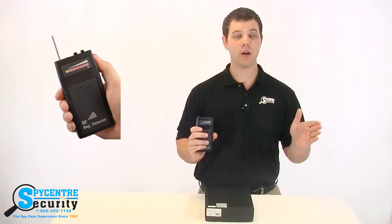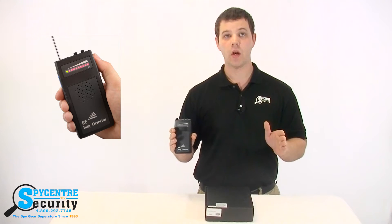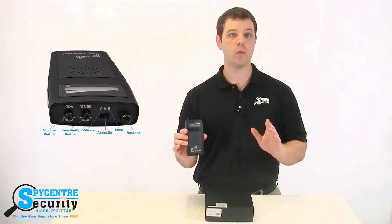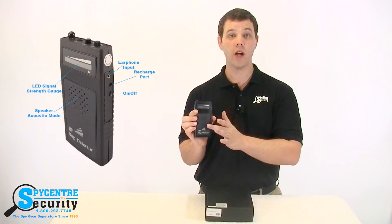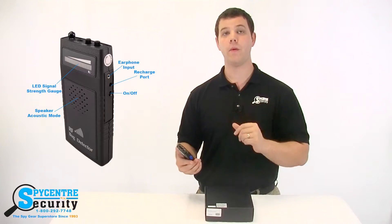The Countertech Ultra Pro is designed to pick up wireless signals between 50 MHz and 6 GHz, which means it can find anything operating between those frequency ranges. Most commonly, these are wireless cameras and wireless listening devices such as bugs. This unit is unique because it has something called audio verification mode — it automatically tunes into a bug and plays what the bug is hearing through the speaker on the Countertech itself. This is amazing for quickly finding what rooms are bugged. All you need to do is set the Countertech to audio verification mode and walk around the house with it. If you hear yourself through the speaker, then you know where to start. At that point, you would switch over to the RF detection mode to pinpoint the bug's location.